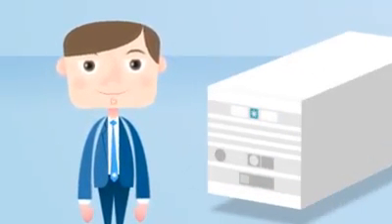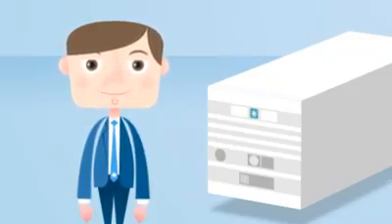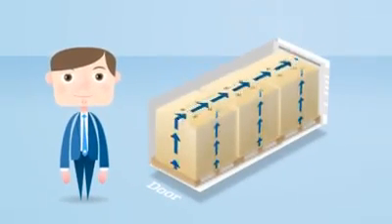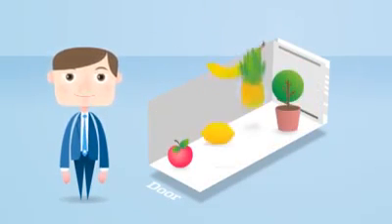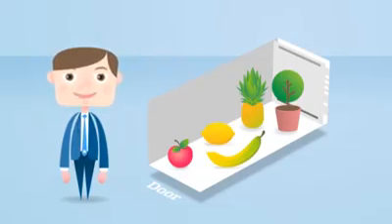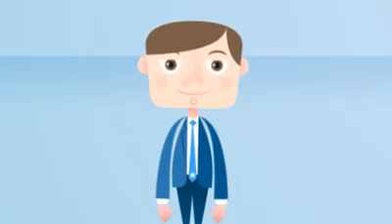Afterwards, air is pushed by propellers through the cooling engine once again and the process repeats, so that air is continually circulated through the container. Some respiring commodities, such as fruits and plants, need additional fresh air. But for most other commodities, reusing the inner air is enough.